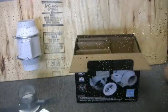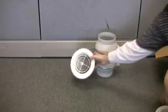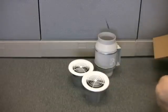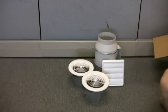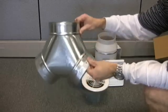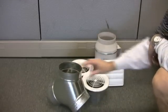You also get an exterior louver for the outside of the house where the air leaves the home, and it's all packaged up in one box and ready to go. If you want to ventilate two bathrooms with one fan, there's a dual vent kit. It comes with the TD-150 6-inch fan, two 6-inch grills, and an exterior louver. It's all 6-inch, and you get a 6x6x6 Y adapter to tie the two exhaust points up to the one fan.